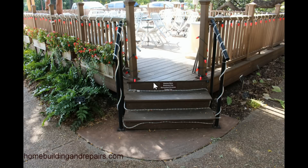Now what do you do if you don't have a nosing? We can see here we don't have a nosing at the top, and I wouldn't suggest installing a nosing because you install something on the edge here and there's a lot of pressure as you walk up the stairs. If you were going to do something like this, I'd recommend cutting it back and installing something at least five and a half inches wide.